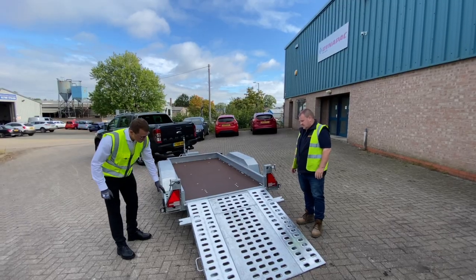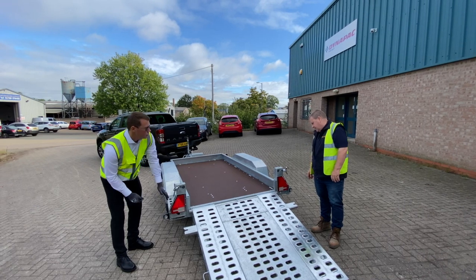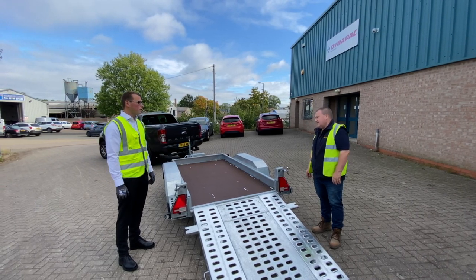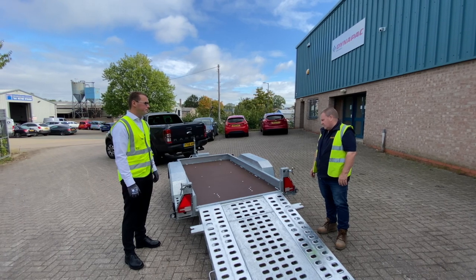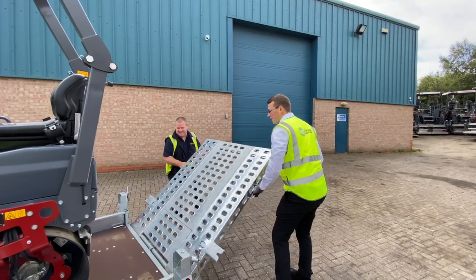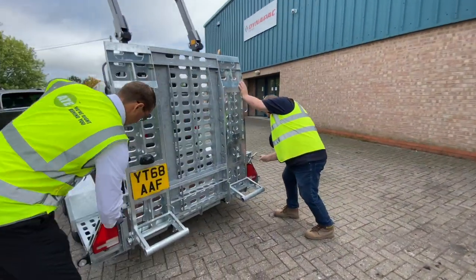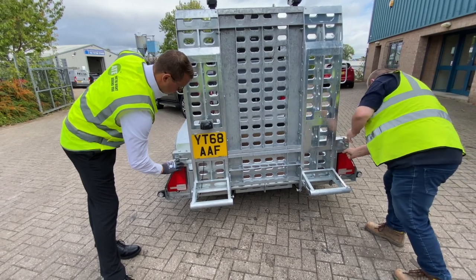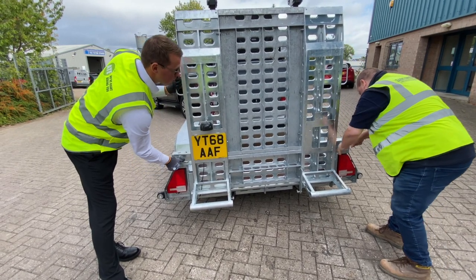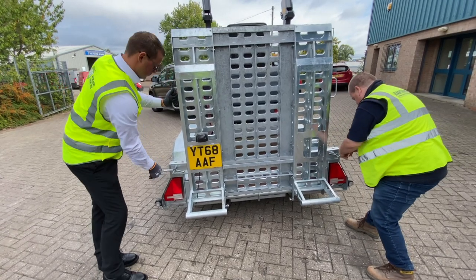Right. So this is some ramp leg supports under here, which enables the trailer to be supported when loading equipment and smooth entry into the trailer. Another key health and safety feature, Nick, is that when the ramp is raised, the leg supports come up out of the way, ready for departure. Over against where prop stands are used, easy to forget and drive away and bend them. Yeah, I'm sure a lot of people have done that in the past, for sure.